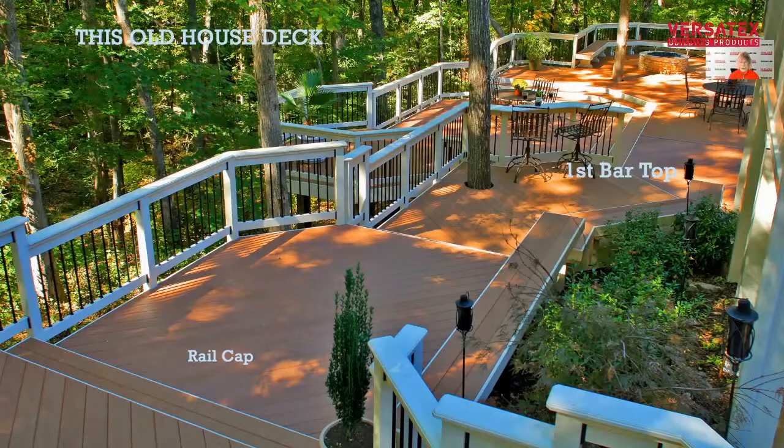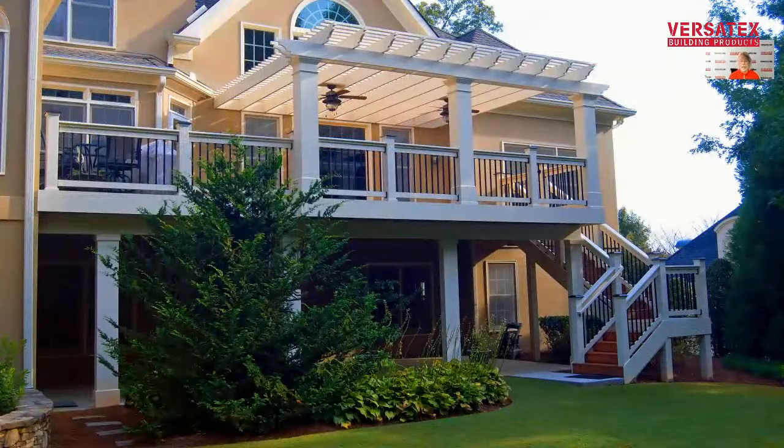And again, at the time, we didn't really trust or didn't feel like we could rely on some of the manufacturers readily. So we were building our own hybrid systems, and we were using the PVC as a cap. And first time I'd ever actually made a bar top or a serving area out of the PVC. A lot of uses. Found that it made a great outer band. It felt like it worked better as an outer band than decking manufacturers' outer band materials. Just worked well, moved less, didn't try to cup up on us.